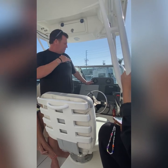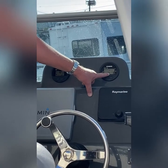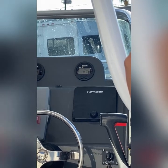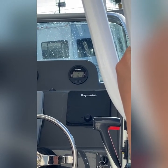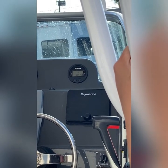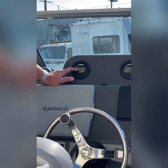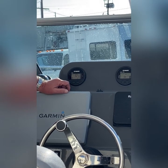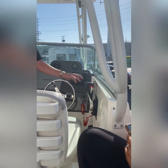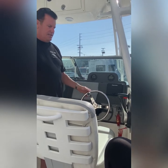If it's relatively flat, put it at 40 and your fuel consumption will be about 7.9 gallons an hour. Up here is your miles per hour — usually 23 to 24. Keep it at 40 on the tachometer. The tachometer is more important than the speed readout. But if it's too bumpy, just lower it and slow down — there's no hurry to get over there. It's a very easy boat.